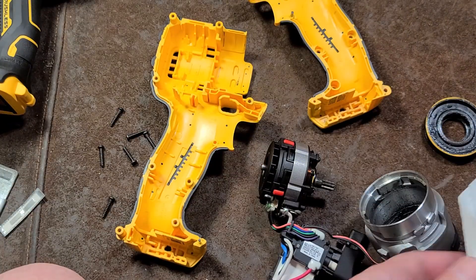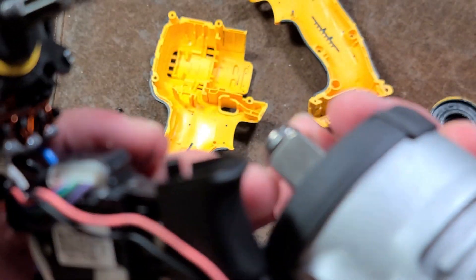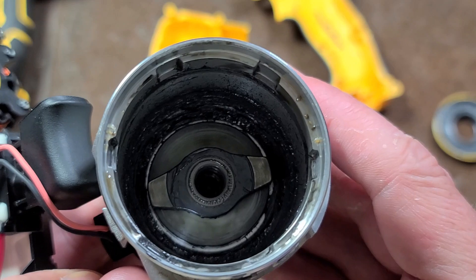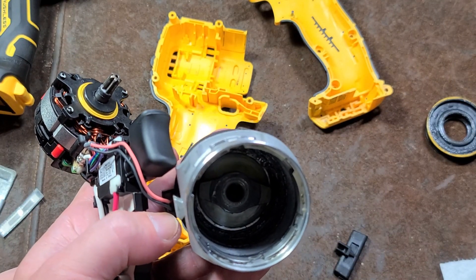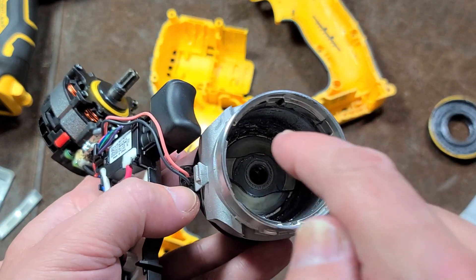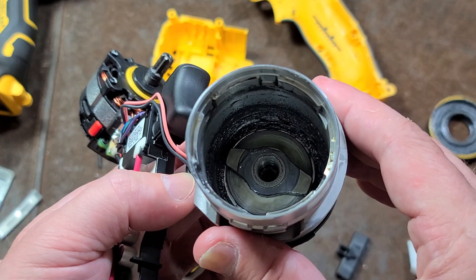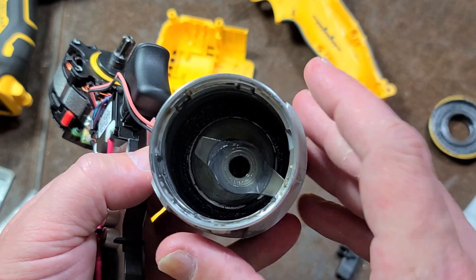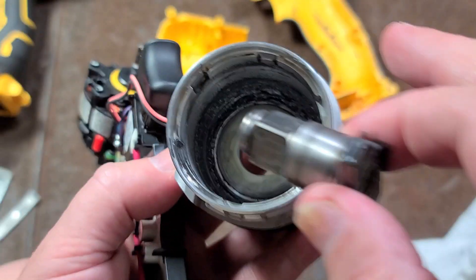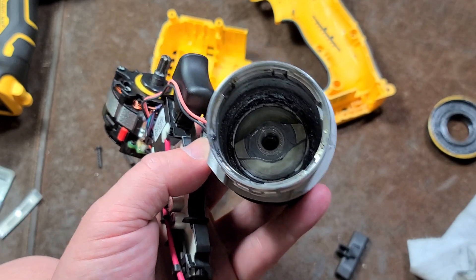There's the anvil. When these usually fail, it's either the anvil shears off right here, or usually it's these two legs that shear off. Milwaukee's corded impact wrenches actually use a similar design — kind of like where the weight is shaped like this, but then this has a bottom plate. The anvil will have a bottom plate to give it a little more reinforcement. Otherwise, it's a real simple design. I did want to see if they used a needle bearing in here — which I doubted — and no, they didn't. It's just a steel sleeve, which is a little disappointing. On the 3/8-inch one, they actually have a needle bearing in that spot.